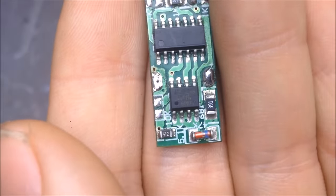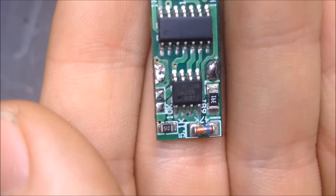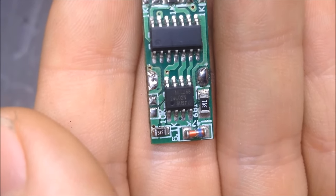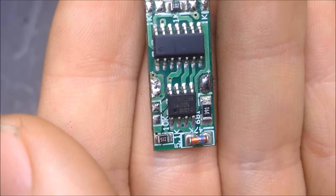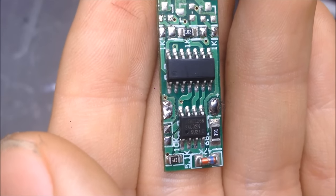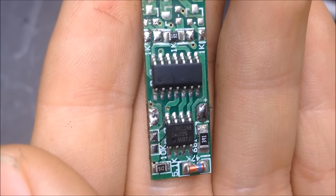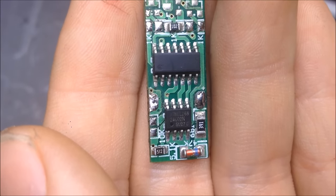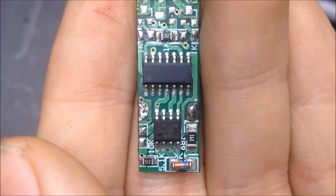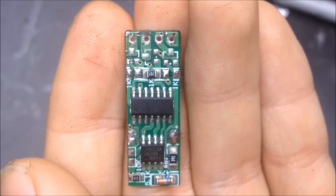Here we can look through, there's the 512 resistor. Next to it you can see it says 5K. So that would be 51 times 100, or 2 multiples of 10, giving you the 5.1K, or 5,100. You can see the 10K is gone, but as you would imagine, that would be 10 with a multiplier of 3 tens, so 10 times 10 times 10, giving you 10,000. So pretty easy to read on those guys as well.